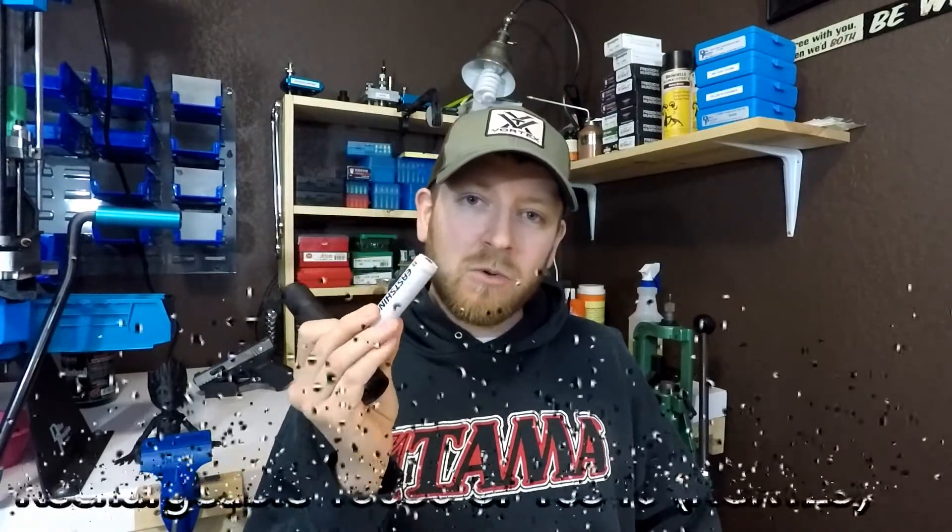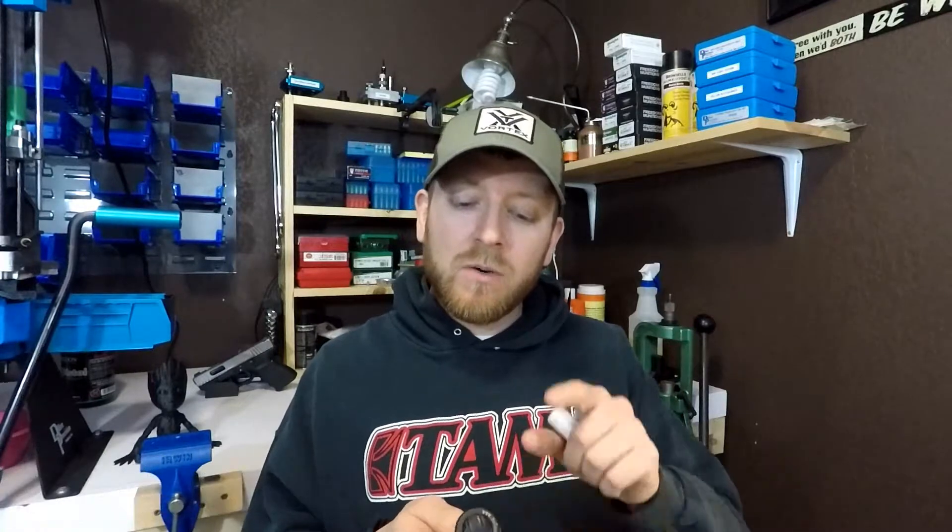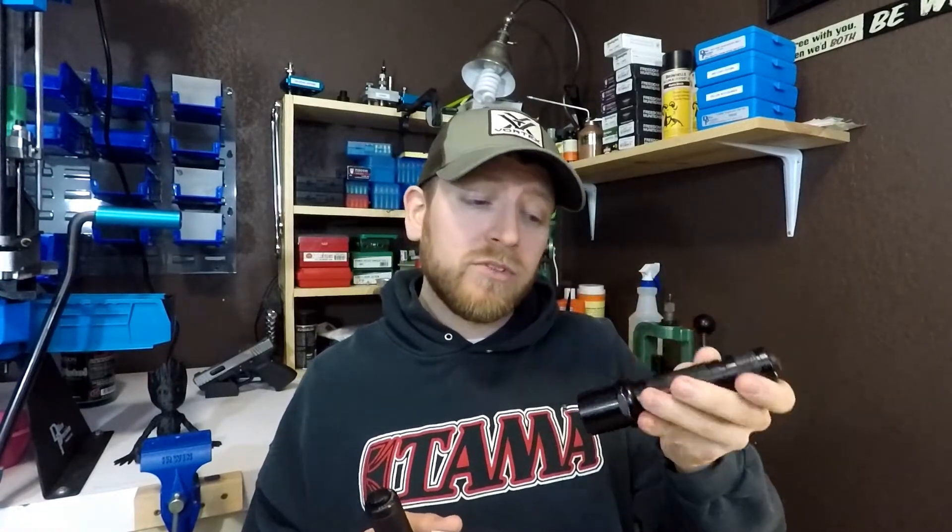The batteries on these are actually kind of neat. This is not a CR-123 size battery — this is an 18650. The body of the Solar Force will easily accept one of these, but the Surefire 6P body does not; people send those off to have them bored out. I'd rather spend $18 on this body and just drop a battery in. The 18650 is only 3.7 volts, and with rechargeables that ends up being about 4.2. You can use lower voltage drivers and not blow them up — which I did in my experimentation when I stacked two RCR-123s and burned out the driver. I really like that you can use RCR-123s or the 18650 in that body.